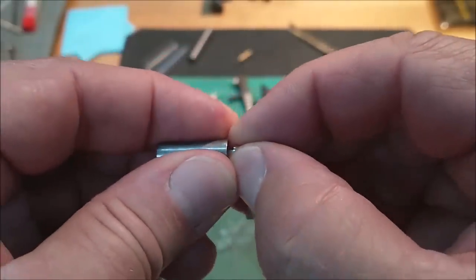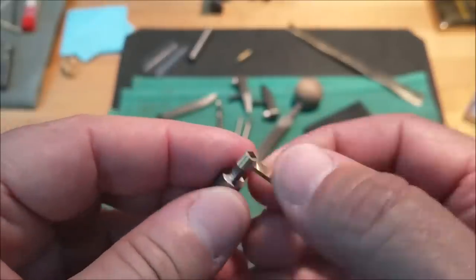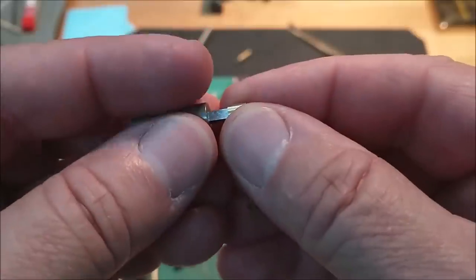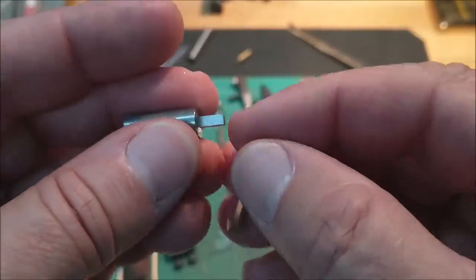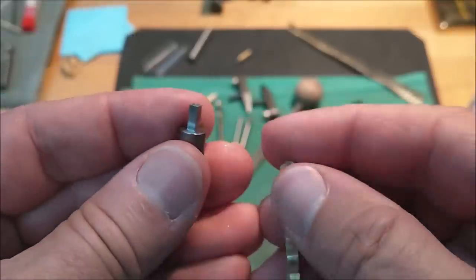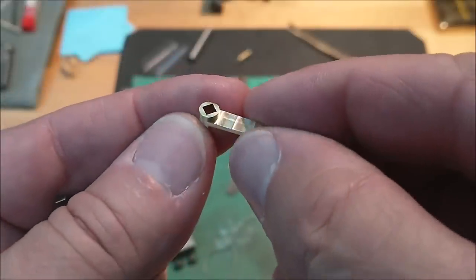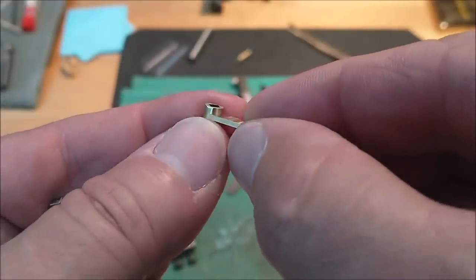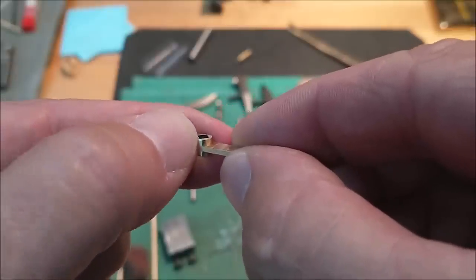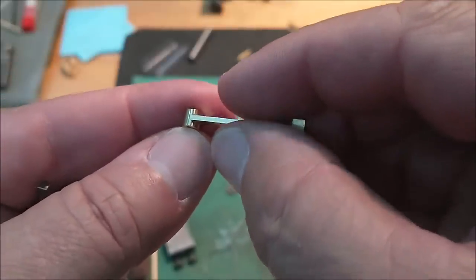The square gauge I have is 2/1000 of an inch bigger than the squares that I put on the shafts on all the drive components on the machine. So everything on the machine in Imperial is 098, this is 0.1. So it's a 2/1000 clearance. You can see the break edge on the material, right where my left thumbnail is. Makes it look like there's a flat, but it's not. It's a very clean transition.